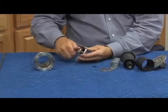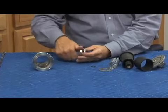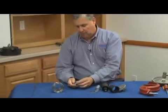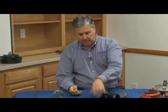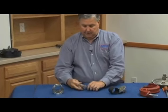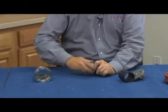Okay, so let's see, how does it work? When we were talking earlier about the construction of relief valves, we had our three little things we were worried about. We want to know about the trip ratio. We want to know about the type of elastic element. And we want to know if it's hydraulically balanced or not. So how does this one work? Put this back together.